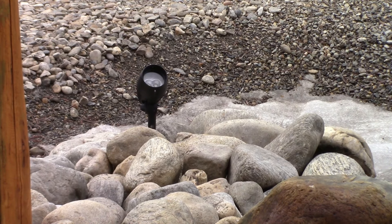We've got to take this light into the garage and see if we can fault trace it. I'm just going to double check - we were getting voltage outside, but let's see if it will work off of a 12 volt power source. I'm using a 3S lipo pack. There's nothing weird with the connector and we'll try reversing the polarity just in case something's wrong with the rectifier - and nothing. So something has failed inside the light, whether it's one of the LEDs or maybe the driver circuit.